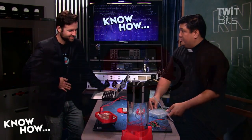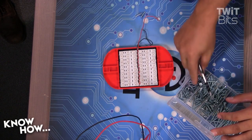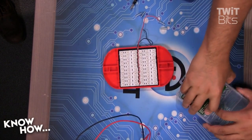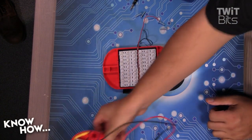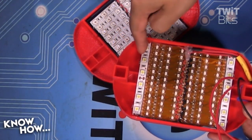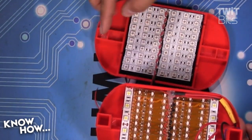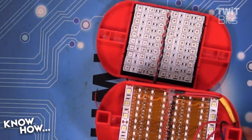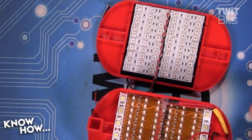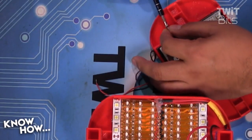You do need a couple of screws. These are 6-32, three-quarter inch screws. What's going to happen is — it won't work on this template because it's a slightly different diameter — but on the actual build there's a build-out here, and that build-out is what allows the LED strip to stay on top. If you compare it, this goes out about 10 millimeters, so you need a screw that's this big to hold it into place. This just goes on the side, like that.